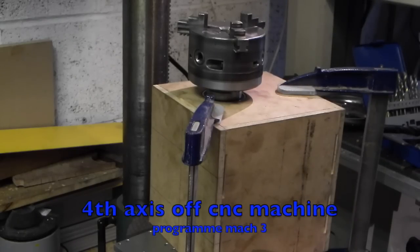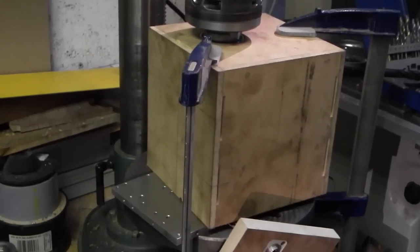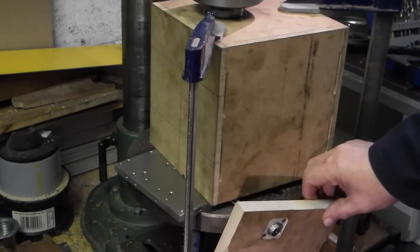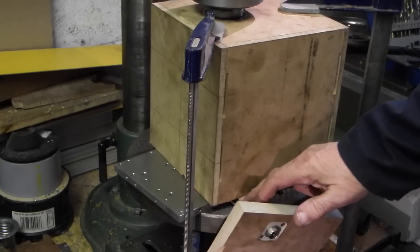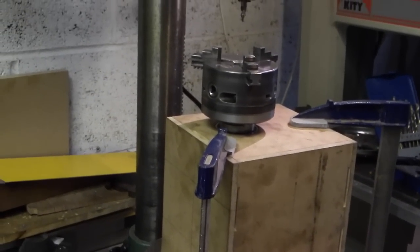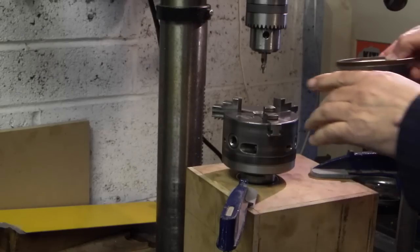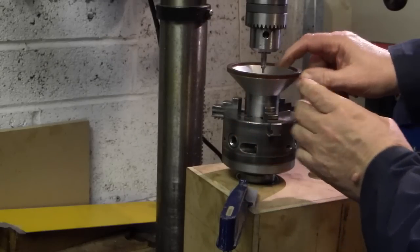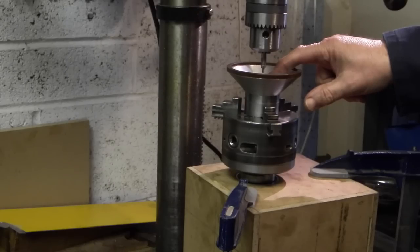This is the fourth axis of my CNC machine and what I've done is I've clamped it to the drilling machine to see if I can use it to get the spacing for the three holes. You can see at the bottom I've had to take the back of the machine off the axis because the plug was on the back. To stop the wires getting crushed I've put it on a 10mm plate to give me a space, and that gives me just enough height to use it on the machine. I've never used it on the drilling machine before but at a push this is centred, and I can get this underneath and just centre drill and drill a 4mm hole in the three locations.